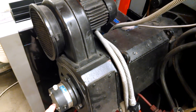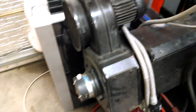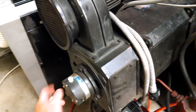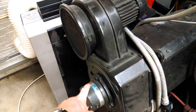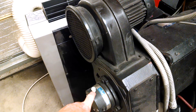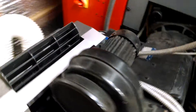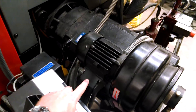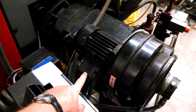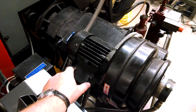This right here is the tachometer for the spindle motor — it's got some brushes on it. I was missing one of the brush caps. Luckily the brush was still in there along with the spring, so I made a replacement brush cap out of nylon on my other lathe. One of the covers for the cooling fan motor was also missing, so I 3D printed one on my 3D printer and put that on there.